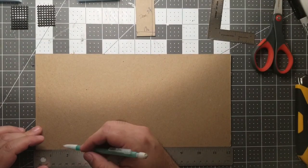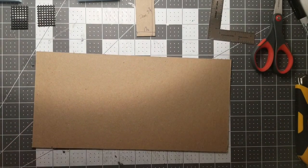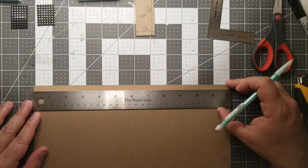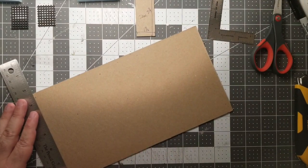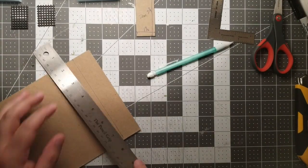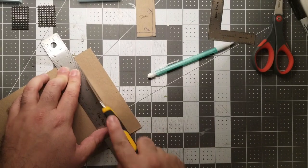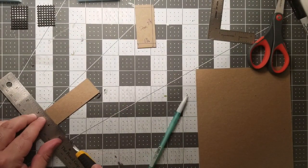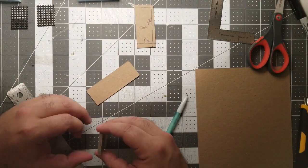Alright, so now let's make those doors. Now, the doors are gonna have a little overhang off the top. So instead of making it 2.5 inches, I made it 2¾ inches tall. And I went for a 1 3/16. I didn't wanna make it exactly the size of the channel so that it wasn't squeezing in there. I made it so that it flowed in and out real nice, and it didn't leave any openings, so that it still was covered by all of the framing.